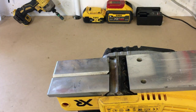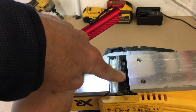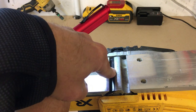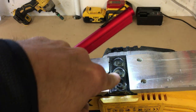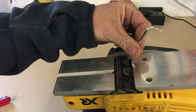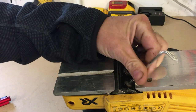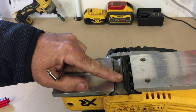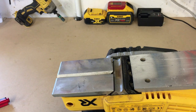Here are the actual blades — you can see them there, and they're held in place by this clamp here. There are actually two of these: one on the top of the plane here and another blade here as well, so these are the blades that we need to change. What we need to do is loosen these three screws with the allen key. This can be quite fiddly — when you lift the plate up once you've loosened off the blade, it tends to fall into the plane, but all you do is take the plane out of the vise, turn it around and empty the blade out.